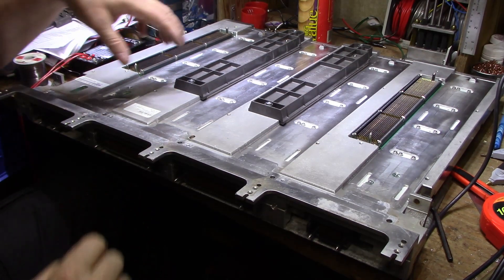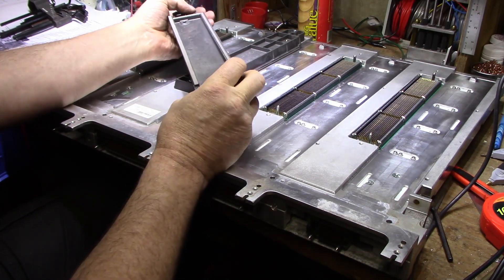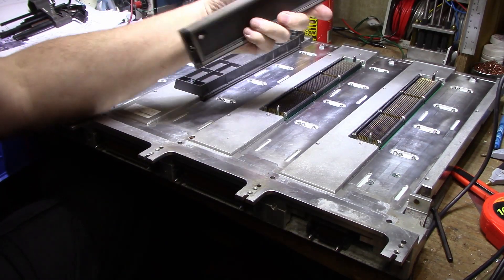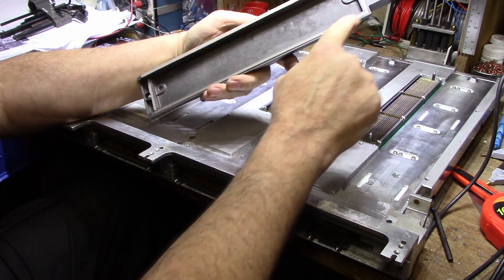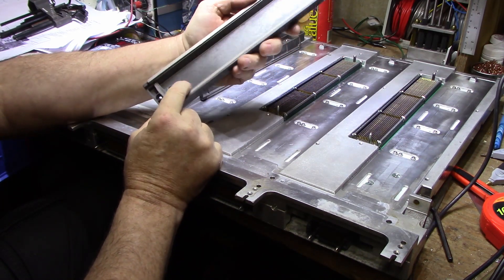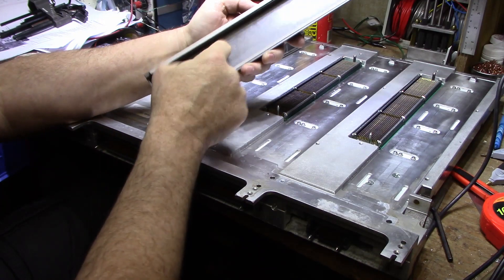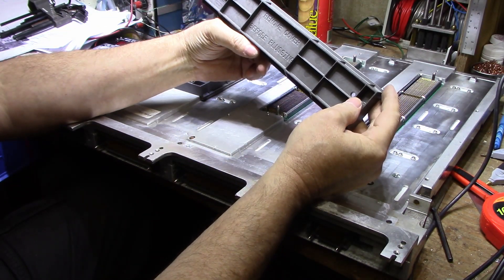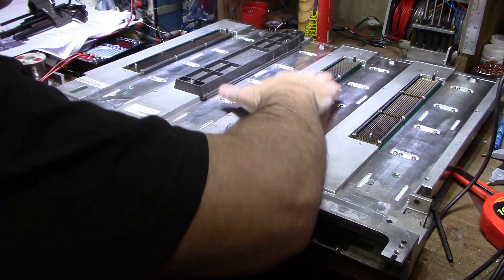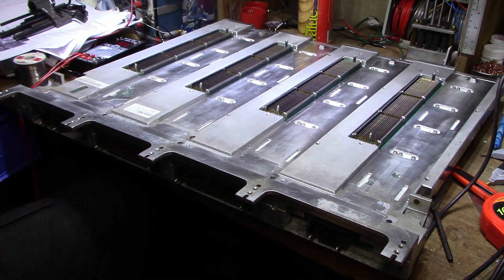I was correcting my assumption — I took off this cover and there's another connector for adding processors — scalable. This is a fully gasketed RFI enclosure. It must be some kind of conductive plastic because they're counting on this RFI gasket here, and it's got a plastic lid for insulation.